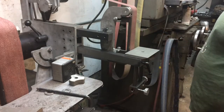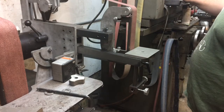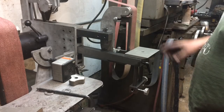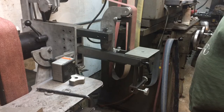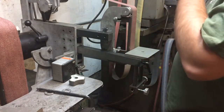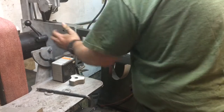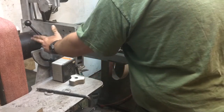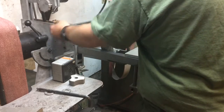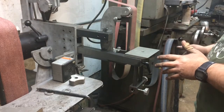I could make a longer tool arm — about 2 feet long is probably what it would take to comfortably get in front of that small wheel or even the 8-inch contact wheel, which is a little bit smaller than the platen and sticks out further. But that poses a couple of issues: I don't have limitless real estate in these tool slots. The bottom two, you're eventually going to hit the motor. The top two, you'll eventually hit the gas spring or the over-center cam assembly. So right now at about 18 inches, I think that's a perfect length for this flat platen.